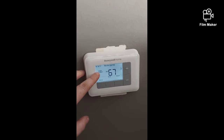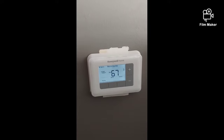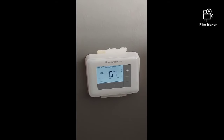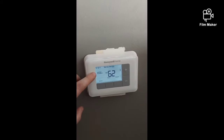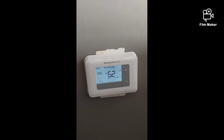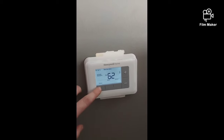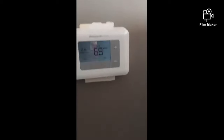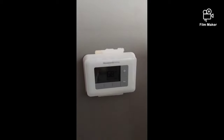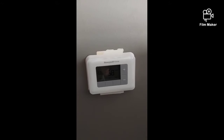The 'home' setting starts at 7 PM and heats the master bedroom to 67 degrees as we're getting the kids ready for bed. When we're asleep around 10 o'clock, it kicks down to 62 degrees — we're in the covers so we don't need it too warm. What this does is make the whole thing programmable so it's only on when it needs to be on. With the traditional old-school thermostat, you had to set it on and off manually. Having these set up in your home will help you save anywhere from 10 to 20 percent on your energy bill.